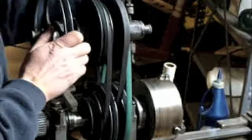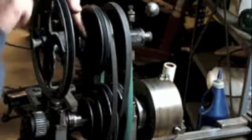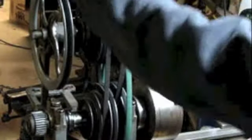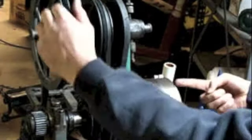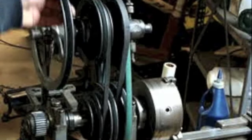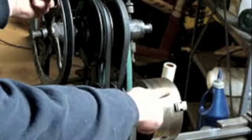Now to get it into the compound drive, I'm going to take the slack off. I've got to move this collar this way — while holding the collar and putting pressure on it this way, you rotate this pulley and it clicks right in. Take up the slack again, and now you'll notice when I rotate it, look how little the chuck moves. If I do about a quarter turn on the input pulley, the chuck jaw only moves maybe not even 45 degrees. I'm just going to hop over to this side so you can see how slow it moves now — if I move the input pulley a quarter turn, you can see the chuck jaws only move about from here to here.